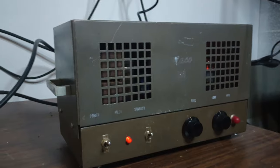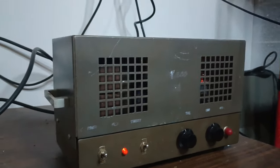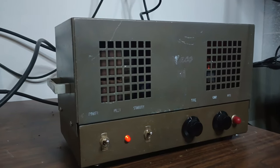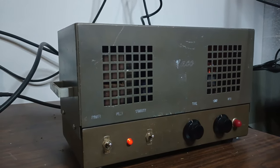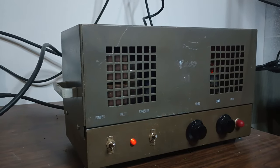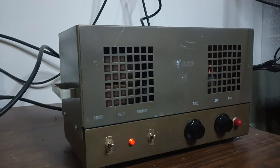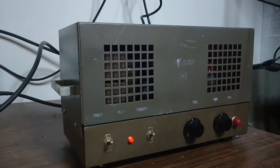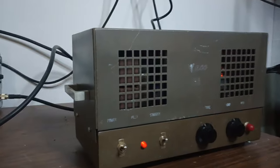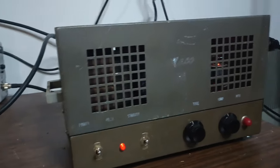Now, he recommended 80 watts PEP going in. In my opinion, it could probably take a little bit more than that, but again, that's all up to you guys. That's kind of what he recommended, 80 watts in and just let it do whatever it does with the four straight 6LQ6s. I have seen some 6LQ6 amps like that had multi-tubes for the driver's side going into four 6LQ6s, but we're going to hit it with about 80 watts as recommended.